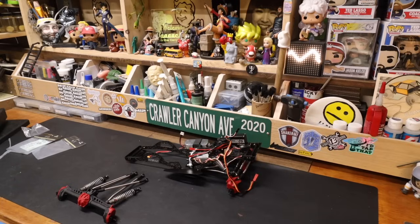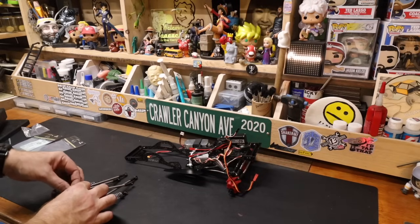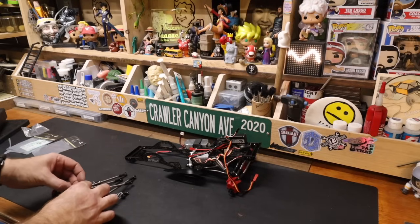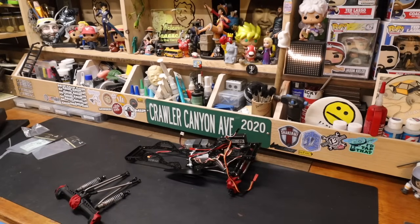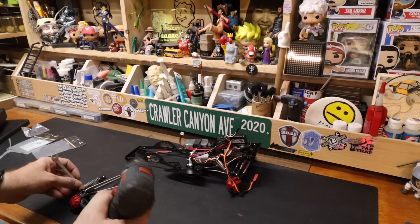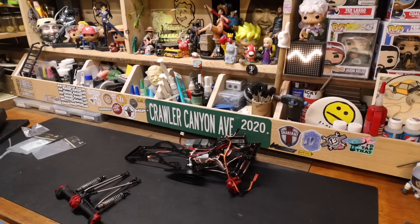Take this advice from me, friendly advice. When you're putting that upper mount on, put the lock nut on now. Don't go, I'll get to it, because that's what I did to the front axle. I just remembered that. There's no spacer for the non-linked side, and there's definitely no lock nut on it, because then what you'll do, by you I mean me, is you'll take it out onto the course and test drive it, and the front end will fall off, because that screw will work itself out pretty easily. Best case scenario is that when it falls off, it doesn't catch anything. Generally, it will catch something, and it will take that thing with it.